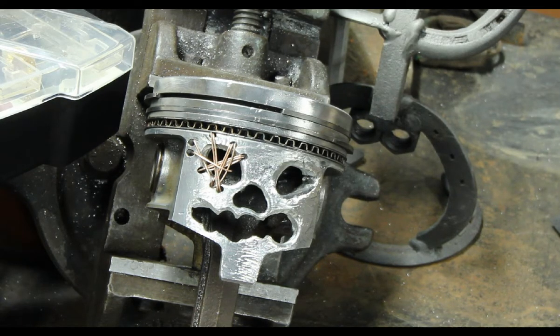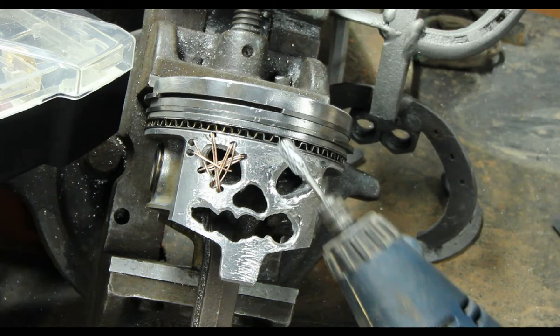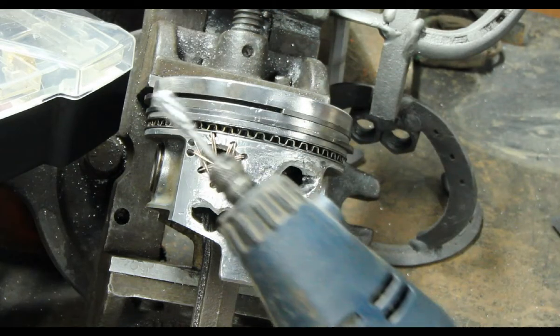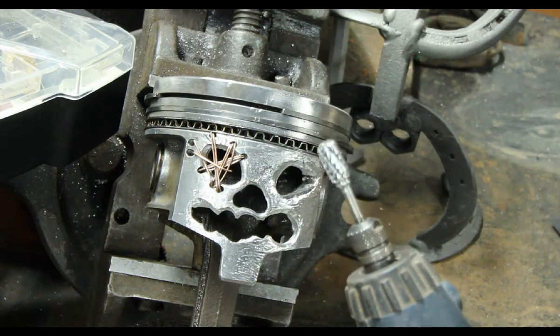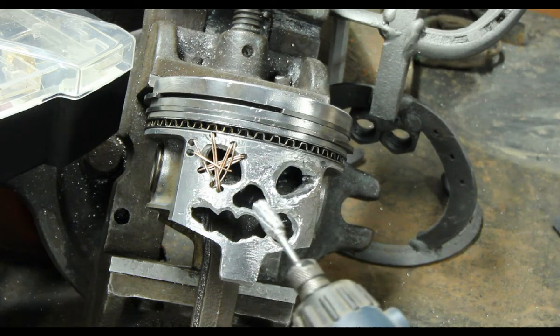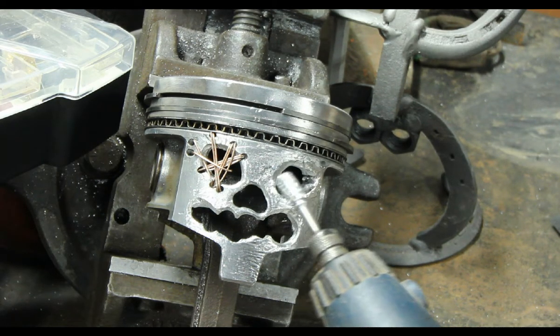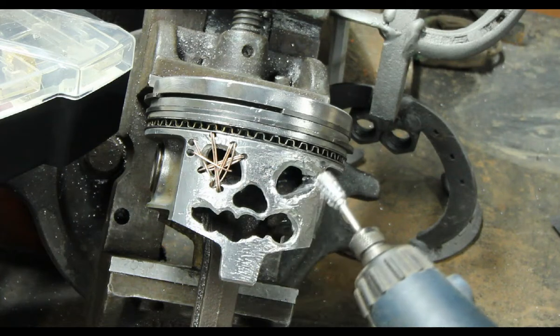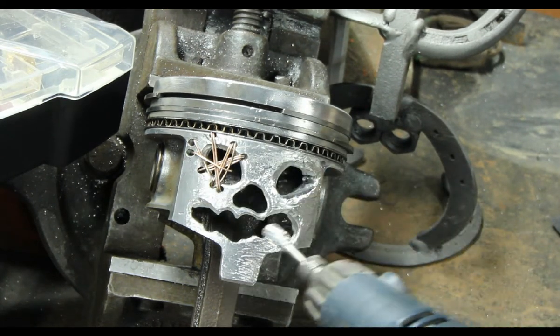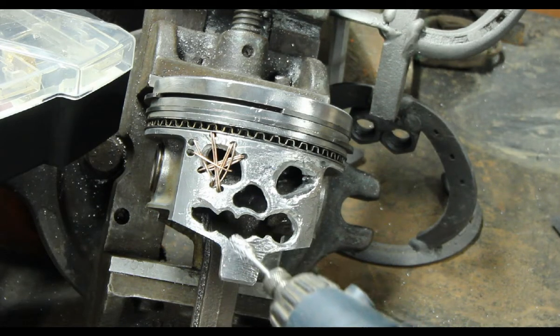And I don't. So what I have is a die grinder. It's a generic model. It's right here. And I put one of those tips in it that he sent me. The first one I busted. I put too much force behind it. It burned up the bit, scrapped it out. And the next one, it's a little bit thick, this aluminum. I went a little bit slower, and I was able to get in and finish most of this out.